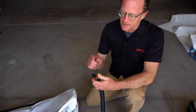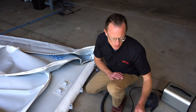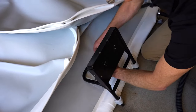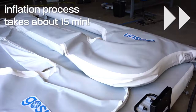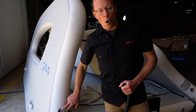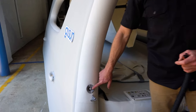We're going to start with the floor. These are a twist lock valve. I'm going to put the power on at incredibly high speed. It doesn't really matter the sequence of which channels you fill up first. But with the floor, you do want to stop inflating about halfway to install the transom — this is where the motor is going to mount. It slips into the floor via these little rubber grommets. It does take a little bit of unique finesse to get that all set up, and once those are loaded in, you can continue to inflate the floor. These valves will automatically lock. There's a setting for deflating where everything pours out, and there's a setting for lock — and it's in the lock setting that you want to inflate.